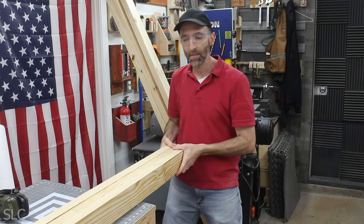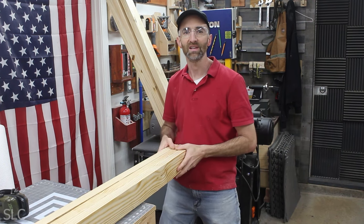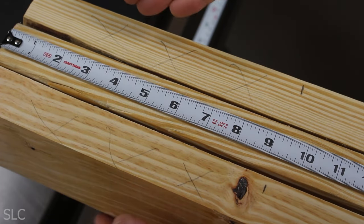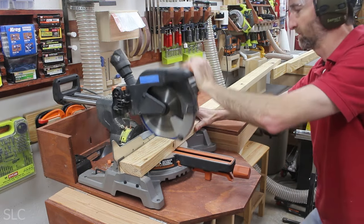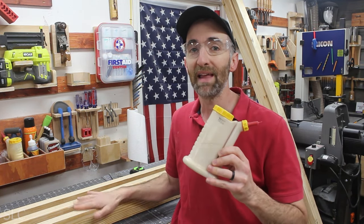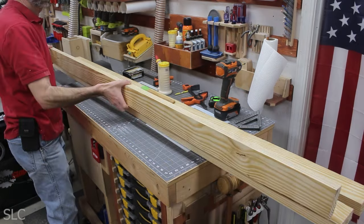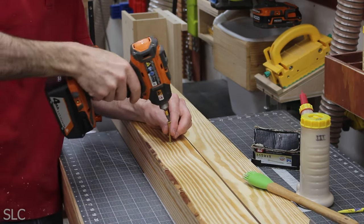Now that we have the wood cut down for the legs, I'm going to laminate three of these together to keep it from bowing and twisting. But first I'm going to trim off 9¼ inches off these sideboards because I want the cross beam to sit on top of them. For most of this build I'm just going to be bolting everything together, except for the legs — I'm actually going to be gluing each of these together so there's very little chance of them ever separating.